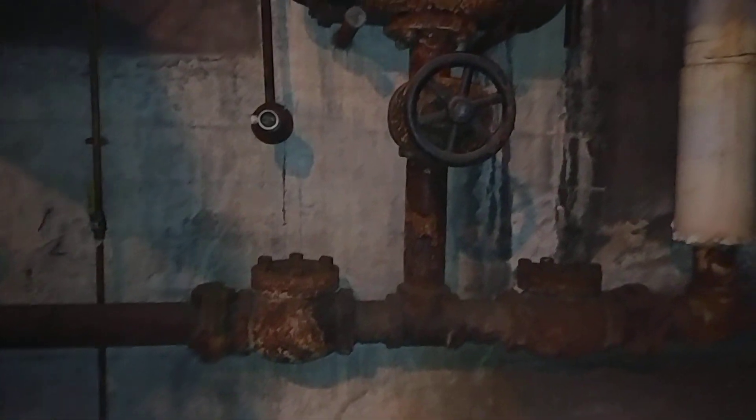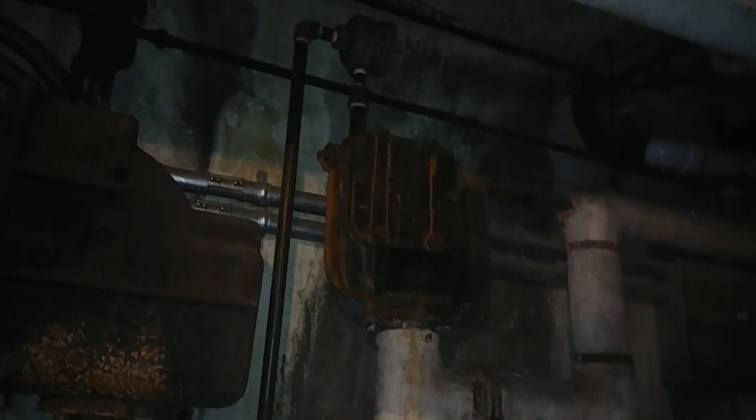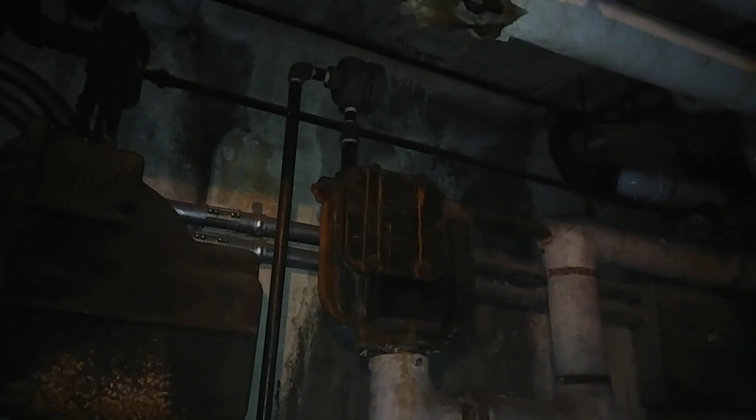It's massively oversized, this boiler. And there's where the air vent is — we've got a big trap acting as an air vent. And if any steam gets in the dry return, that'll shut there. This probably was a wet return at one time, but it's now a dry return, and it's kind of slowing things up. It's a fairly complicated system; I don't want to belabor the point.